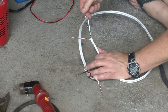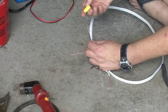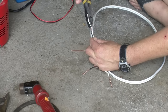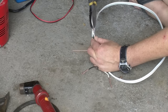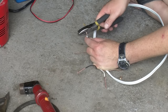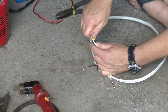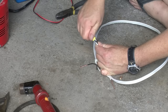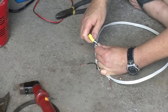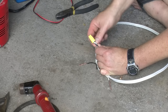For the other end of the wire, I'm going to join the two wires together with a mar connector, or a wire nut as some people call them. To do that properly, you should twist the ends of the wires together before putting the connector on. I once lived in a house where none of the wires seemed to be twisted together — we may test that later. I'd think the twisting makes a significantly better connection because there's already a good connection between the two wires before you put the nut on.